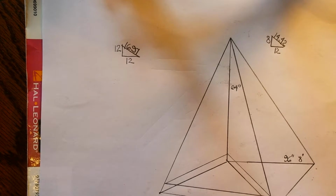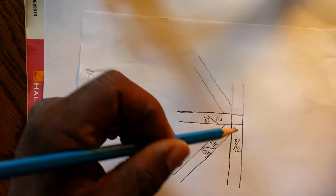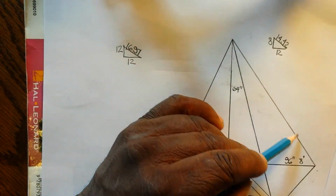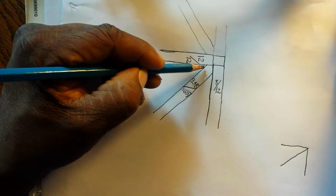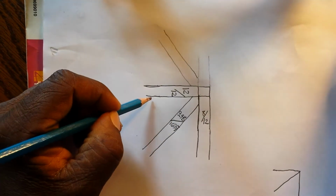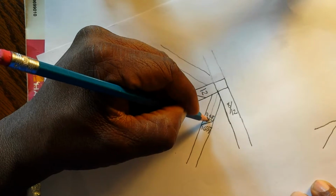All right. So now that we have our height from the top of the wall plate all the way, and this is one of the reasons why I wanted to draw this, your measurement right to here. In other words, this line right here represents exactly this line, the one that the hip butts right up into. It doesn't represent this line over here, which is 1.5 inches away from the hip. You see? And on this side, of course, that line represents this line here.